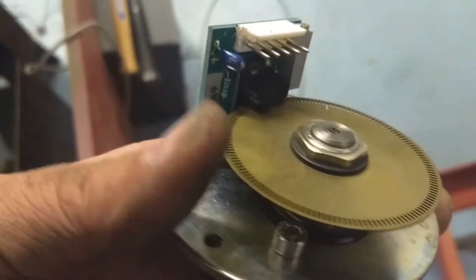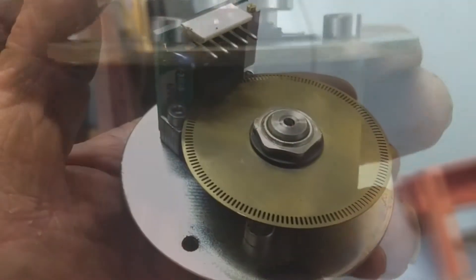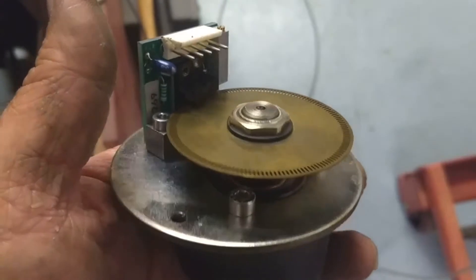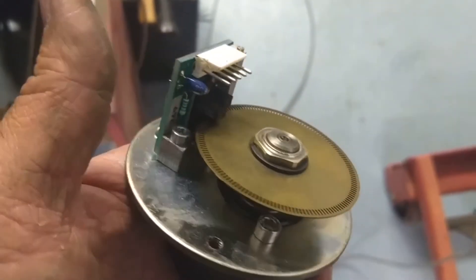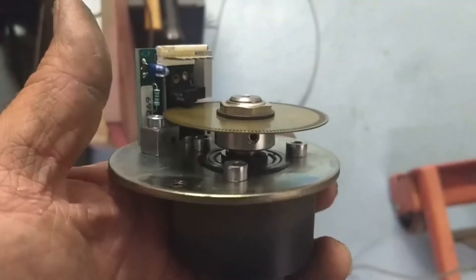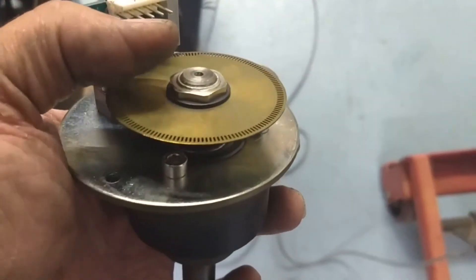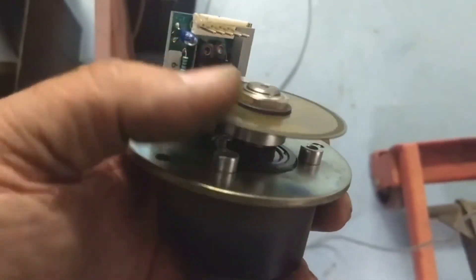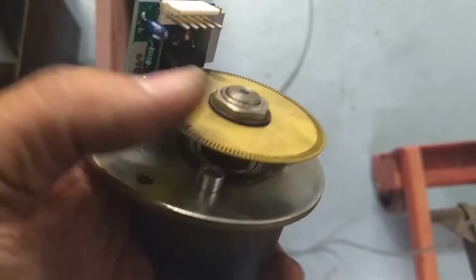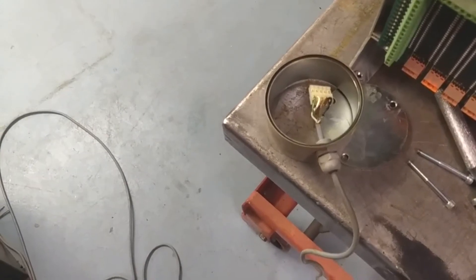There's a better picture of what the encoder looks like. What I have to do is adapt an encoder onto this existing shaft, so it won't be too bad. I might be able to turn the shaft down a little bit so that a standard encoder will fit it, but this shouldn't be that big a deal. It's going to be enclosed in a case so it'll keep the garbage out of it.